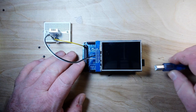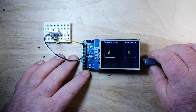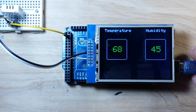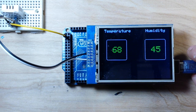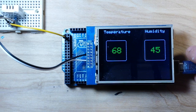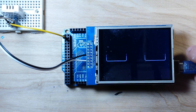Everything is set up and ready to roll. Power on — first it comes up as zero and then, bada boom, there you have it. One thing you'll notice is that the screen wipe is kind of slow, which means you can actually see it happen. I'm not really happy with that, but for a $15 LCD screen you're doing pretty good. If you don't like it, instead of wiping the screen between delays, you could just print the current temperature in black and then reprint it in green — that would probably make things work out a little better.